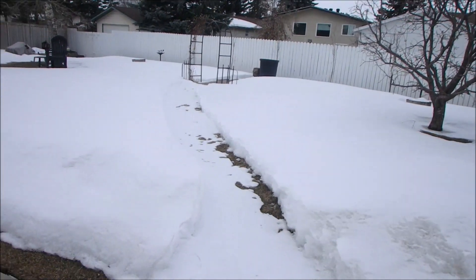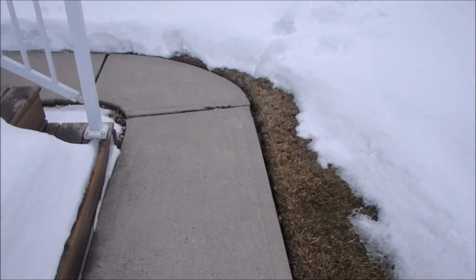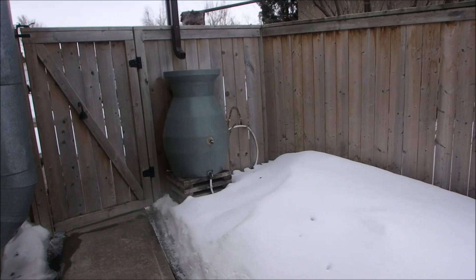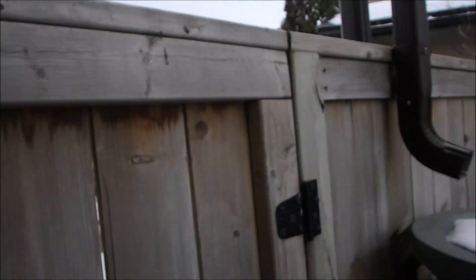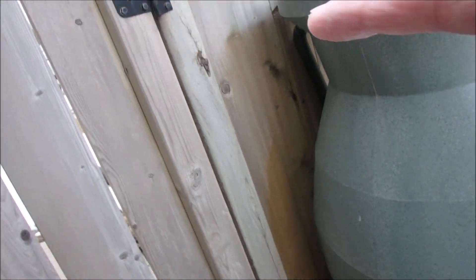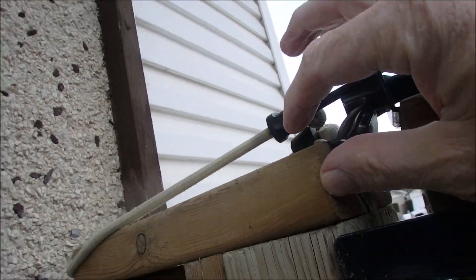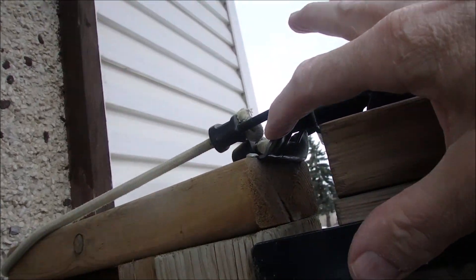The groceries are coming — it's a big deal! You guys have seen this: it's my rain barrel, my snow barrel. Our neighbor had their tree cut down last year, and we did as well, but now I think there's more moisture in the ground and this post heaved, which has made this gate inoperable. I'm going to put a quarter-inch shim right there, the full size of the top plate, just so that this will come up to here.